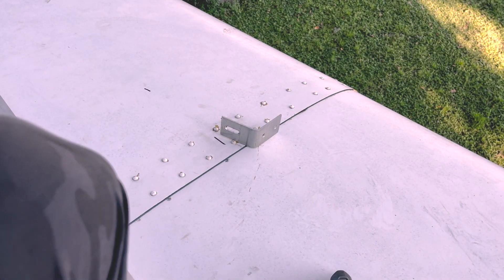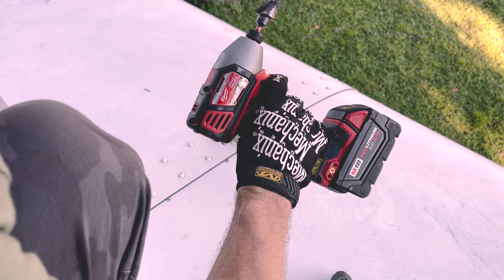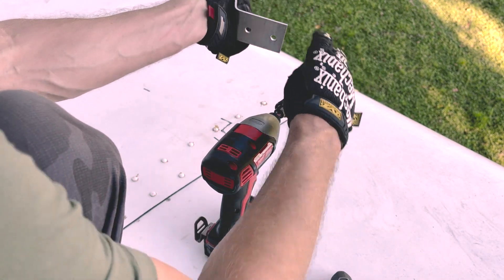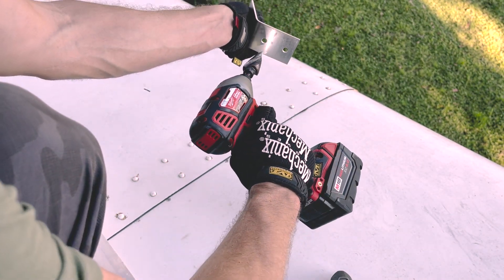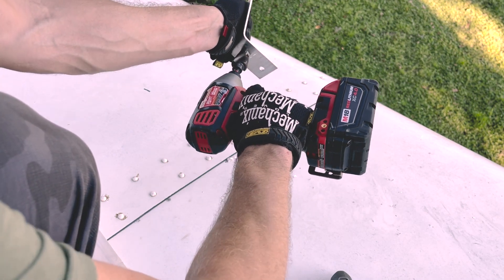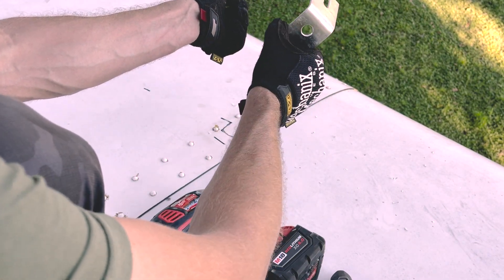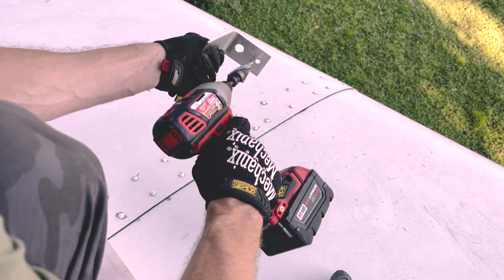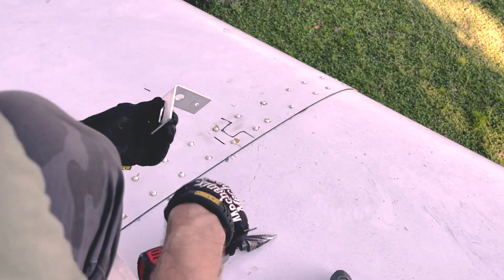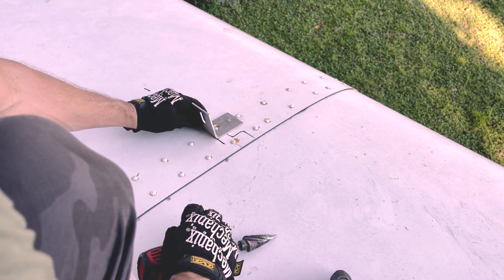The safest way to do this part is probably with a drill press, but this is how I do it — I can't recommend it to everyone. A regular drill does not work well. Make sure the bit is sharp. I hold it in my hand with gloves on, and if it were to catch, the drill rotates to the right so it would pop out away from my hand. I open this side and hit it just to put a chamfer on it, and now the bracket can go right where I need it without issue.